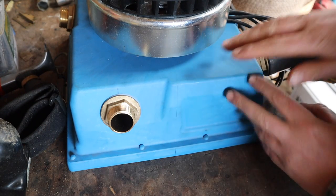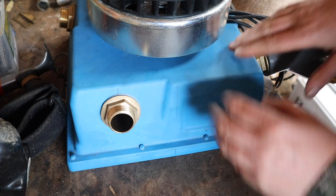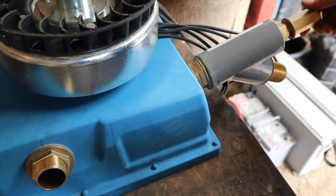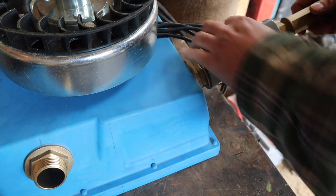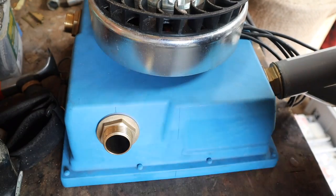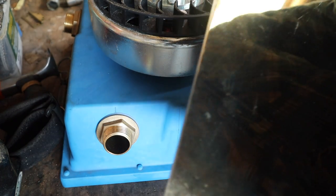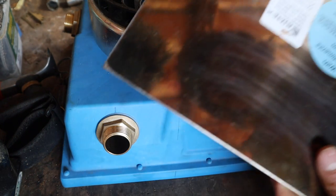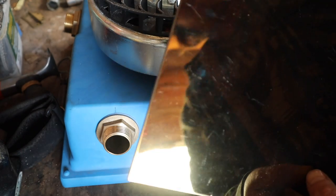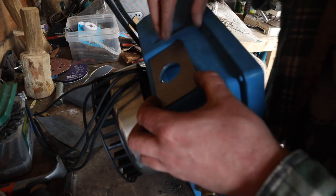What we've got here is a glass-fibre reinforced nylon housing — quite strong for its purpose — but I'm adding a significant weight to it with this nozzle. I can actually flex it up and down now. I'm going to put a big stainless steel plate out here that everything attaches to, and also stainless steel plates on here to stiffen it all up. I've got some stainless steel plate — it's got some sort of bronze coating but it's stainless — and I'm going to cut it to make these bases.